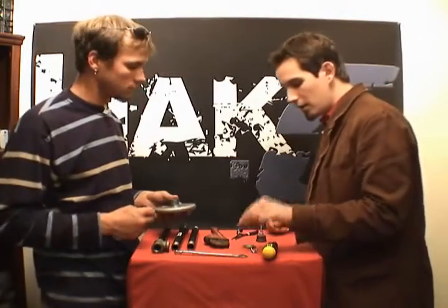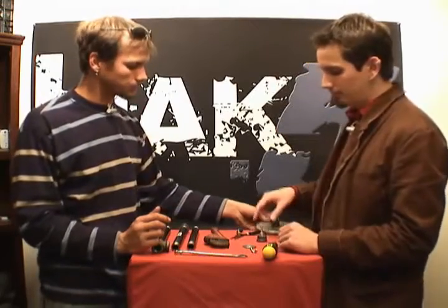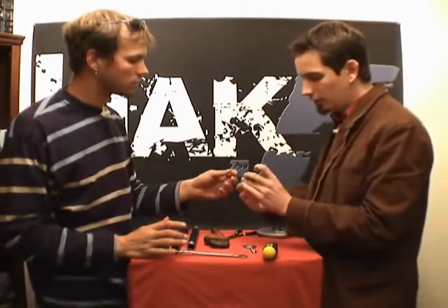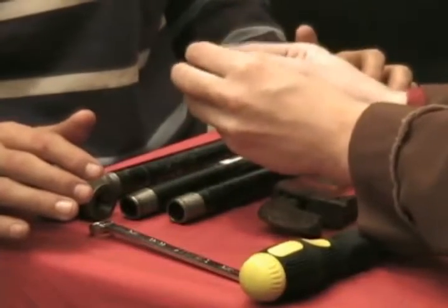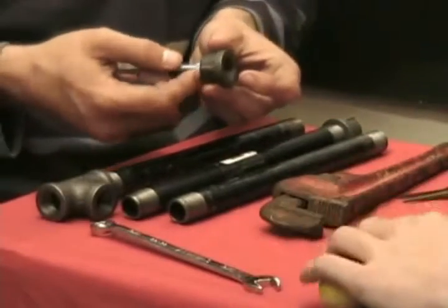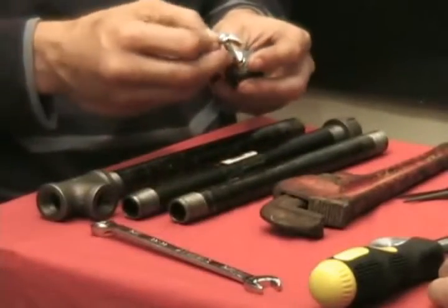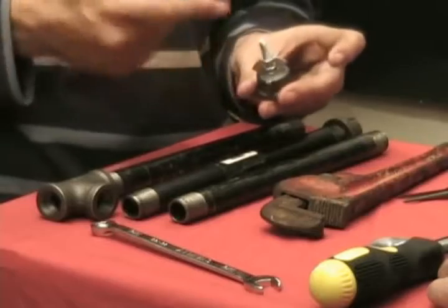Cool. Okay. So what about for the camera end? All right, the camera mount, that one looks a little funky. So when you've already got it started off, I see we've got the cap here with the bolt going through it, nut on the other end. Yeah. Underneath that nut's another lock washer. Great. Now here you take a wing nut, put it on upside down. You'll see why in just a second.